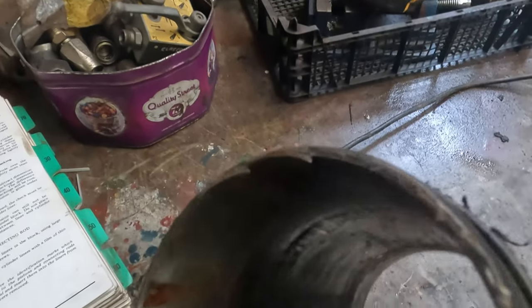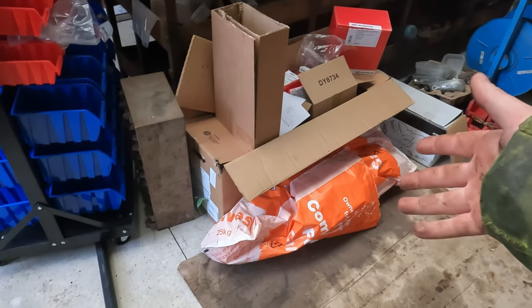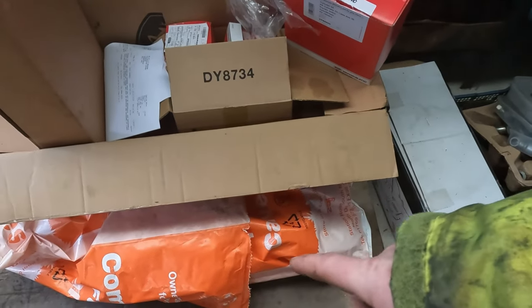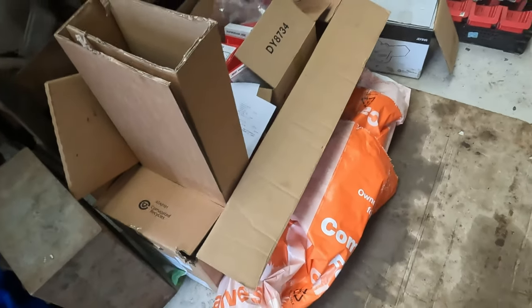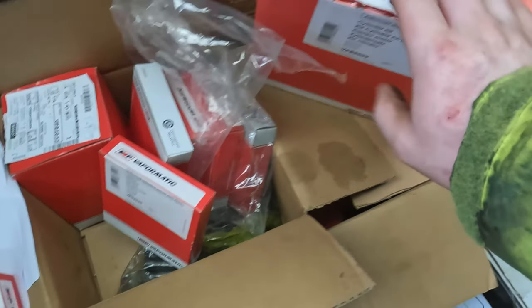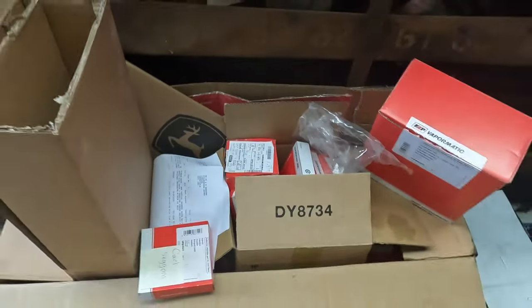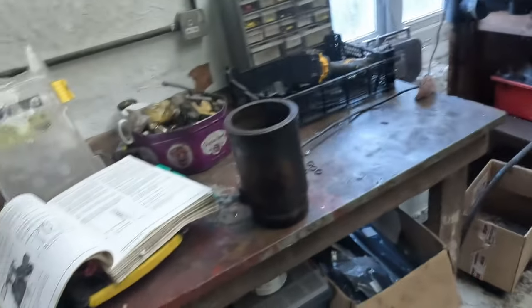I'm putting new liners in. In that bag is the crankshaft covered in oil - I've wrapped it in bags inside there because it's so damp at the moment, just to keep it from rusting over again. That was 10 over. You can go up to about 50 over, so that really wasn't that bad. In that box is the engine kit: injectors, oil pump, liner and piston kit, cylinder head bolts, gaskets. That's either a rocker cover gasket or a head gasket. When you're doing a rebuild using the Vapomatic engine kit, you do want to get a proper John Deere rocker cover gasket because they give you a cork one but it will leak.